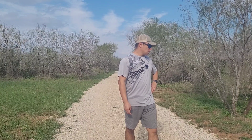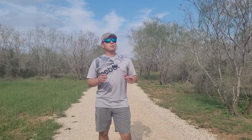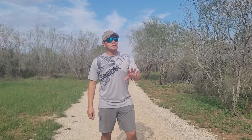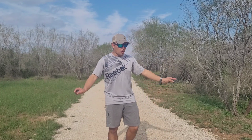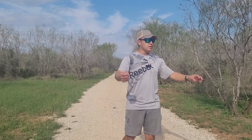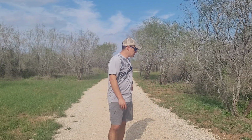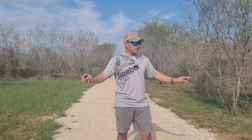What else? It's also about 6 inches thick for the most part. There are a couple places where it's a little low-lying on the driveway, so we added a little bit more base to bring it up level. There are some places that are a little bit thicker. The edges are a little bit thinner, probably about 2 or 3 inches thick on the edges, and a little bit more thickness where the tires run, and a little bit more in the middle. Overall, about 6 inches between the tires and about 2 inches or so on the edges.